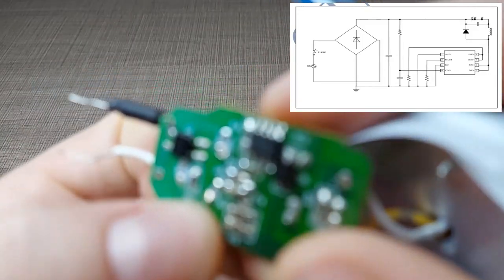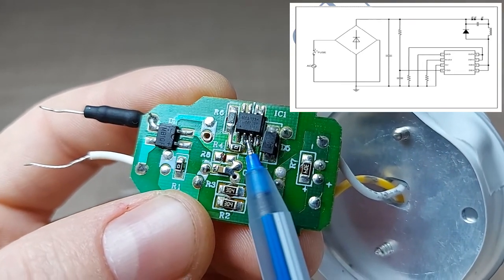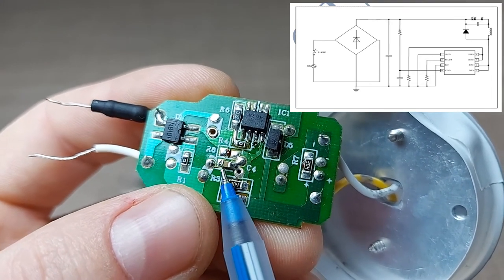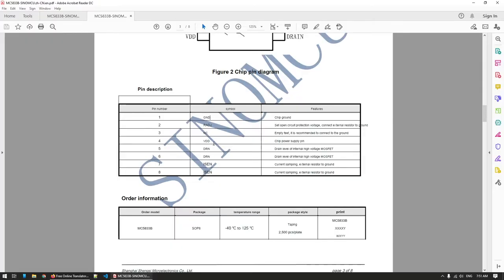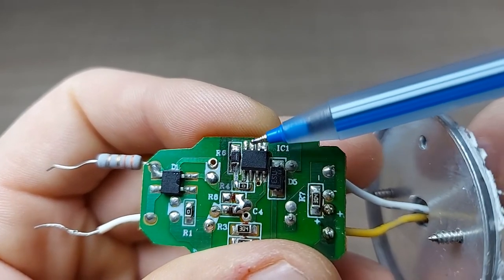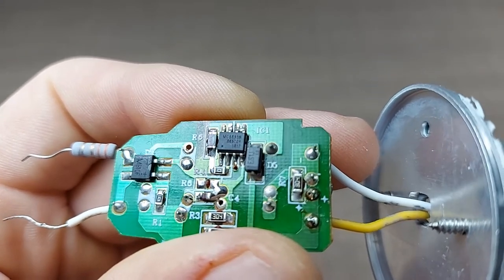On the other end we have the current sense resistor, which in this circuit is 2 ohms. You can't really see it here but it's definitely visible on this one — it reads 2R00, so that's 2 ohms — and that's connected to the current sensing pin. Then we have the other two resistors and the capacitor as per the circuit, and one goes to the VCC pin that defines the supply voltage for the chip. If we go down in the datasheet we can see all the pins and what they do. Pins 7 and 8 are used for current sampling and are both connected to the same resistor, because both outputs are also connected together, so we get the same current from both outputs.